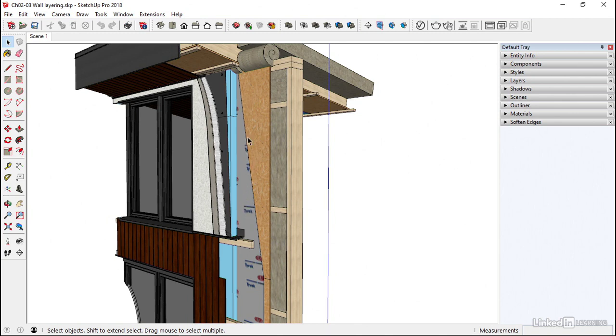Now this thing will sit over something like this. We also need to have a board of some description, and this oriented strand board is good enough. You can use ply as well in certain situations. And we need this so we can fix things through to it. Because we've got a timber frame behind, we can't necessarily fix wherever we want. So this mesh, which is fixed through this insulation and through the breather membrane onto this, is going to hold the mesh in place. Also, the insulation will be fixed back to this thing. Okay, this will also be tacked back to this. So this thing becomes quite a structural element. It also adds stiffness to the frame.